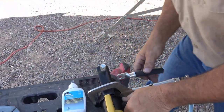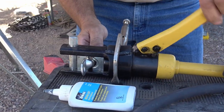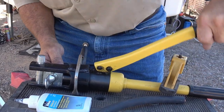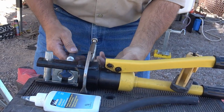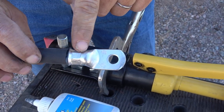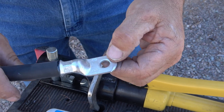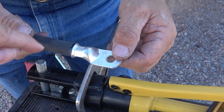After doing that, I'll put the cable into the hydraulic crimper - a nice man gave this to me. If you put enough grunt into it, it really does a good job. And that's what it looks like right there - beautiful. The head of the wire gets in there, and when you crimp it, it causes a knot up here and then it can't slide out. I'd hook it to your pickup and haul something with it - I guarantee it won't come apart.